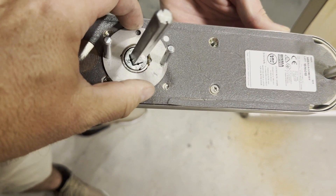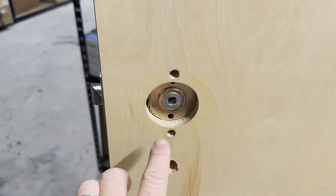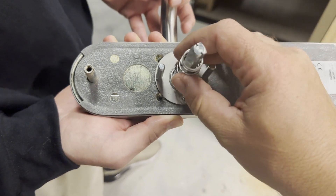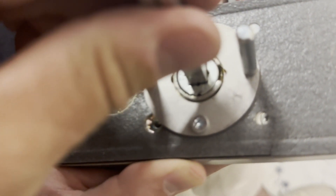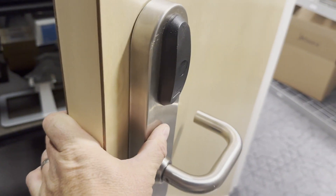Now we're going to put the spring kit on. This is going to go in there — there are little holes underneath. We'll put this on and screw it on tight. These rods actually go into the latch right here, which makes the latch more secure, so that when you turn the handle, it's only going to turn the center part and not the big part, which would pull it off of the teeth. Put the spring on with the smaller side up, make sure the hole is facing up, and then it's ready to go in. Make sure those rods go through the little holes in the cylinder, and then it should fit. Hold onto it, put the backside on, put the two screws in, and then that's secure.